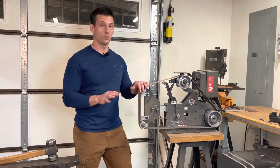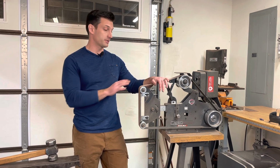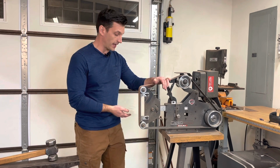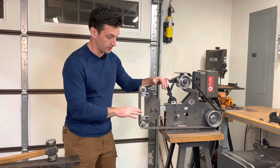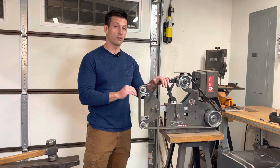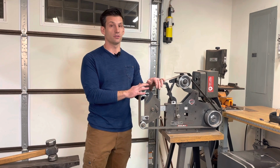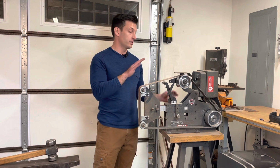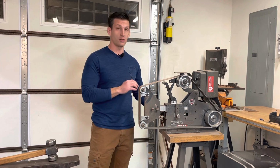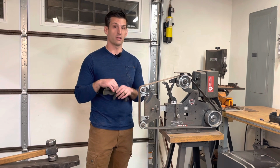One danger when it comes to gloves is that the belt grinder can grab stuff, specifically not the glove itself, but the belt grinder can grab the glove. If we were using a flat or a platen to lay the knives on to grind something, you have to be aware to not let the belt grab your fingertips or something and pull your glove off. That could cause serious injury as well. But yeah, the number one thing is respect the belt grinder, and wear your gloves, and that's going to increase your fun factor as far as making your knife.